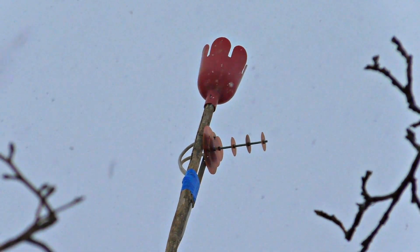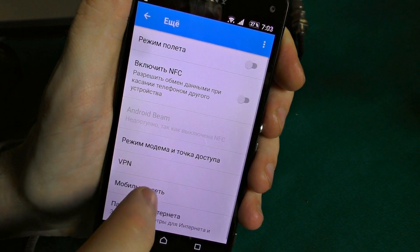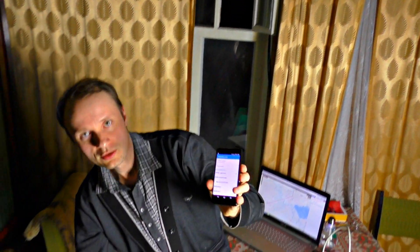The distance is 34 kilometers — some people said the maximum is 12 kilometers. That means the blaster makes wonders! As a bonus, here are some techniques to ensure you get a nice signal. First, find out what frequency your provider uses. Go to the network settings and try to find the network — indoors, outside, on the roof. If you can't find your network, get to some higher place nearby within a 5-kilometer range.